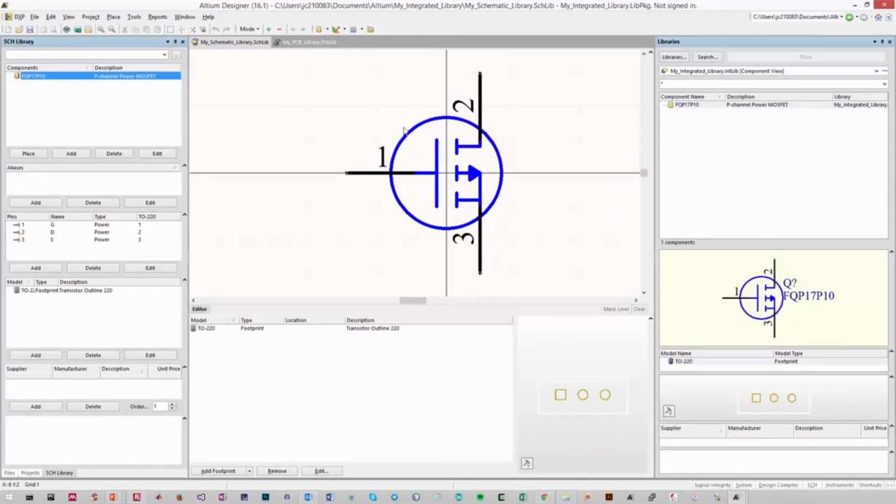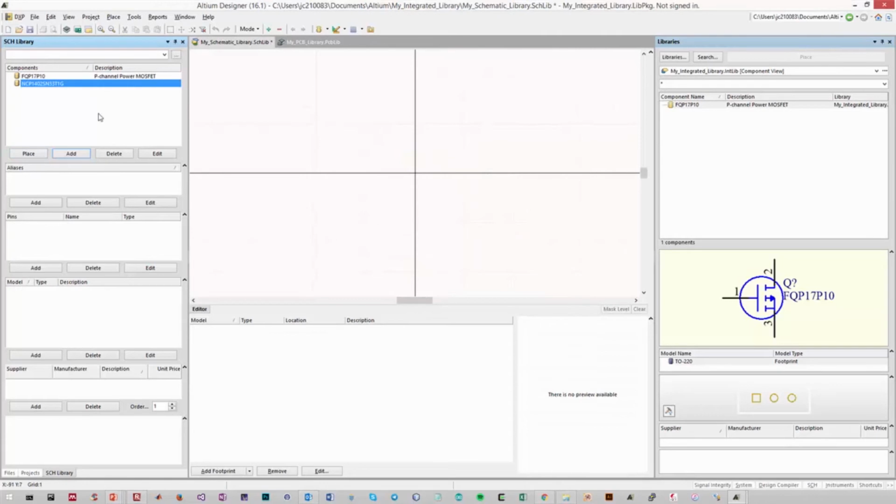This is our schematic library after creating our through-hole component. We're going to be adding a component now. So select the pane for components in your schematic library and select the add button. In this case, our component name was NCP1402SN33T1G. It's a long component name. And let's set up some other properties of it.